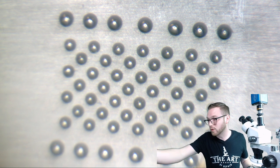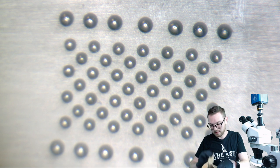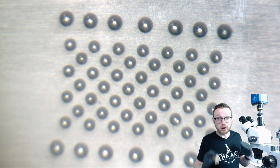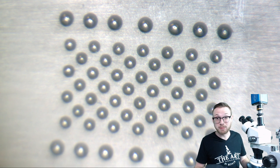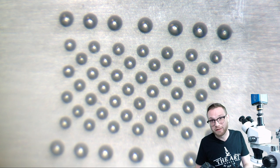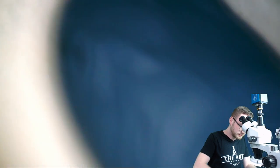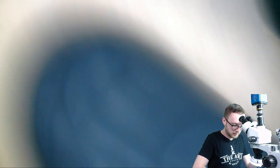Okay, so what we're going to do is we're actually going to take a small piece of sandpaper here. I know this is the fun part. This is going to be awesome. And we're just going to sand over it. Now you definitely want to use something extra as fine grit as possible because you don't want to grab these pads and pull them up or do anything. I mean, calm down before you get ahead of yourself here. Super fine grit, nice and slow. Let's just get in there and get these things flat, okay? I would generally be very gentle starting out.